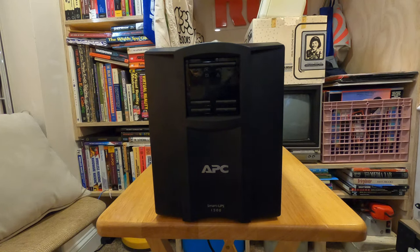I bought this as 'used working but has no batteries,' and when I received it it actually does have the original batteries from 2015. But when I powered it on it says 'please insert batteries' — they're completely dead, shorted. My plan today is that I've ordered some replacement batteries. I'm going to take the wiring off the old batteries, put it on the new batteries so they slot right in, and then power this thing up and hopefully it just chugs on as though nothing ever happened.